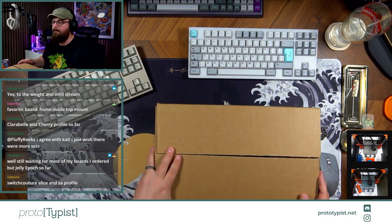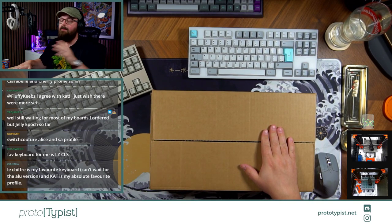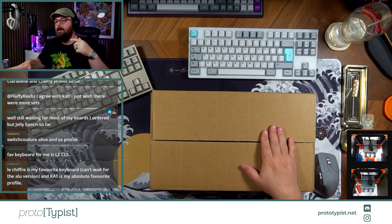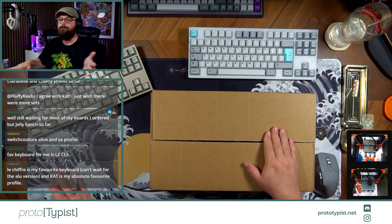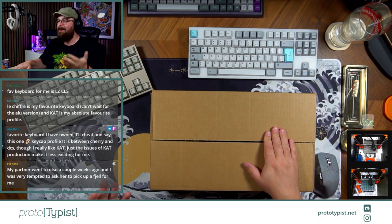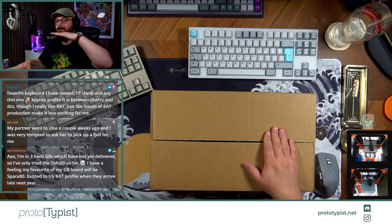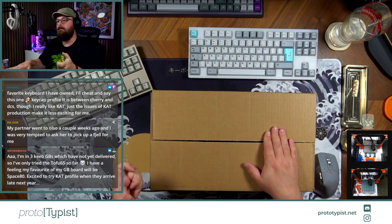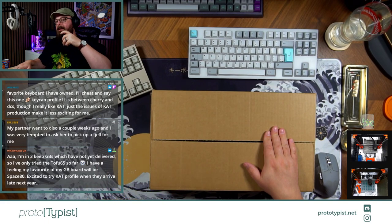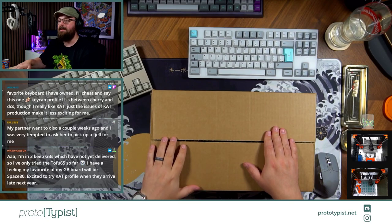Okay, so this is the base of my IM165. Basically, I patinated this myself in the workshop the other week. I've done this a few times before, but I wanted to try and do it in a bit of a different way. So what we did here is we had a big tub, and that tub had some chemicals in the bottom. I'm not sure how much I can say on Twitch about this, but it was basically ammonia, right? It's just ammonia in a mug of all things. And then we've raised up out of the solution the keyboard part, and we sprayed it down with a mixture of vinegar and salt. So it's basically salted vinegar, just standard white vinegar and standard salt flakes all mixed together. We sprayed it, and this is what we came out with.